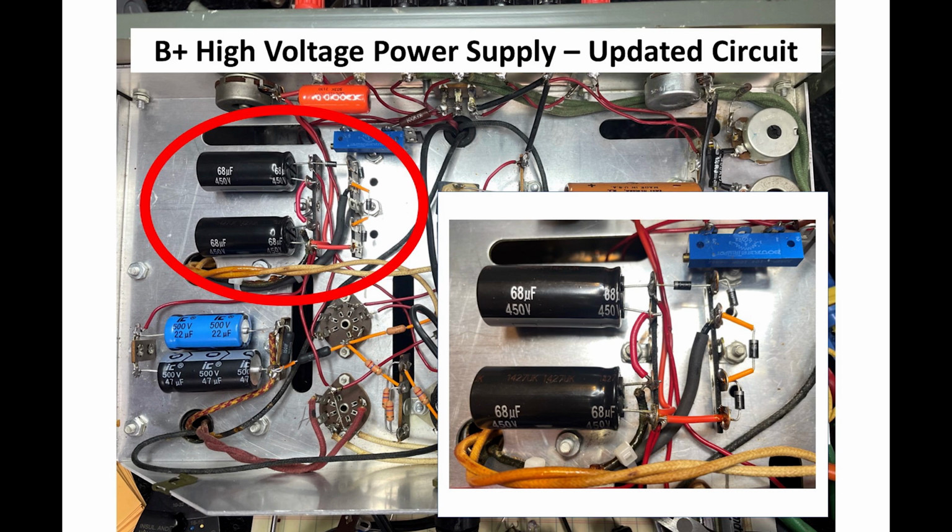If you check the polarities at 10 volts and you go, oh yeah, I'm cool, you still want to make sure before you put the power to it. Just take a couple of extra minutes and you'll be a lot safer that way. All right.